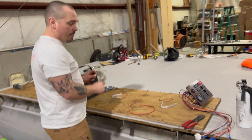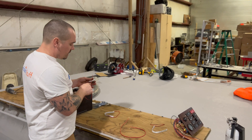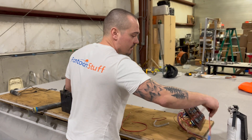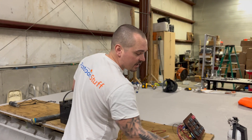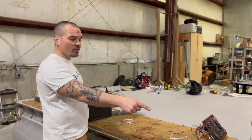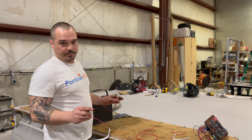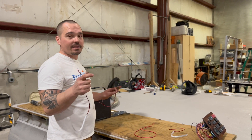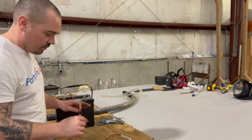The ground's always going to be connected — it always can be, and it's not going to hurt. So for an example, I've got some LEDs here. This is my port side of the boat, this is my starboard side, and I want to get power to both of these LEDs. I want to run one strand of wire from my switch panel — this panel actually has an accessory wire coming out, an orange and a black. Orange is power, black is ground. If I want to continue a run of wire off of that, a red and black two-in-one, I can run it straight out to an accessory. Solid black is always ground — just keep that in mind.